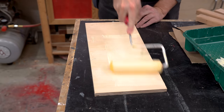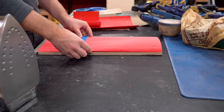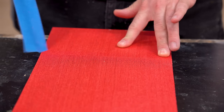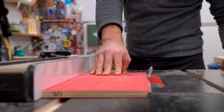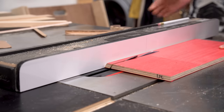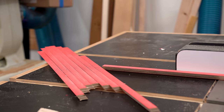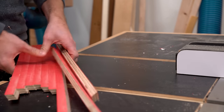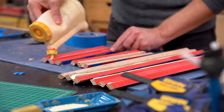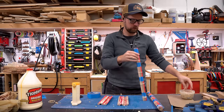I really liked how those patterns were going, but I was super curious to see what it looked like on half-inch plywood. Fortunately I had a bunch of red pieces left over from my veneer pack, so I added those on with the same iron technique. My theory is that the half-inch plywood is going to show off the veneer a lot more because with the material being thinner, the veneers are actually going to show up more frequently in the pattern. I also wanted to test this out because I'd like to try making knife scales out of this stuff at some point, and at the three-quarter-inch scale I just don't think there's going to be enough of the pattern showing on the side of a knife. These parts are exactly the same as the previous glue-up — the only difference is that I'm gluing them in two different orientations: one will be the MC Escher cube and the other will be more like a v-shape.